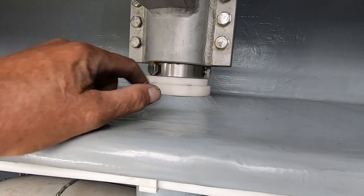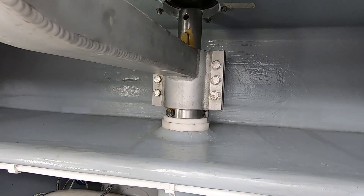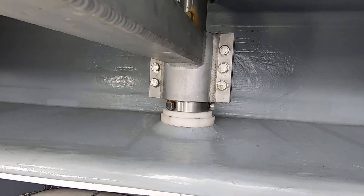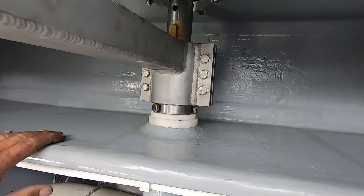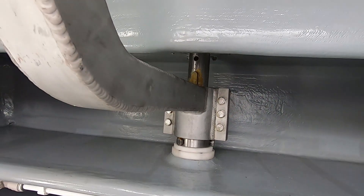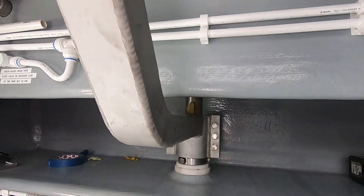Aluminium and stainless steel do not go well together at all, especially if you add a bit of salt. New collar: stainless steel, with bolts not grub screws — a lot easier to get out. The original problem was probably a lot of fault of our own — we saw the leak on the last trip and when we got back we went straight into lockdown. We should have pulled the rudder apart and removed the collar then, because it would have come off. But standing for a year and a half with the moisture, that was obviously the reason why it seized up so badly — probably no fault of the manufacturers, but also because of COVID preventing maintenance. Bit of both. The steering gear is back and reattached.